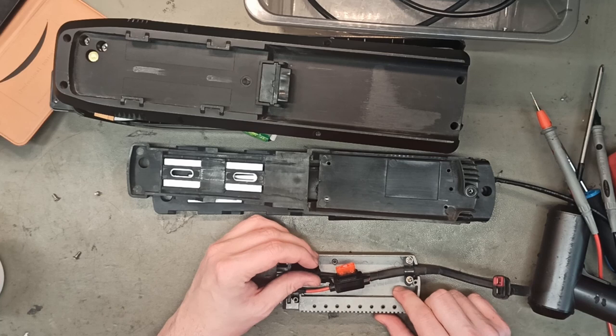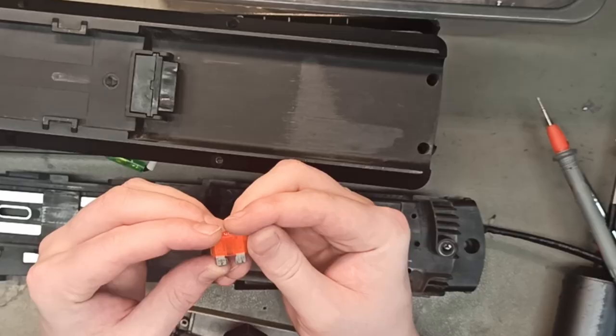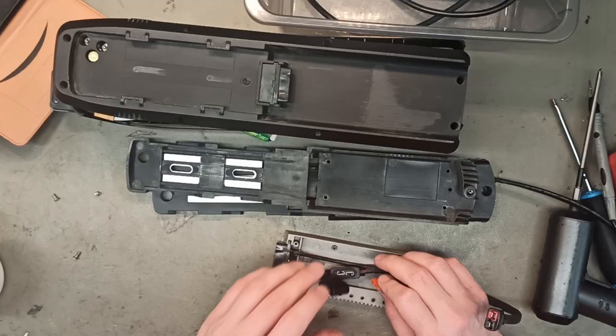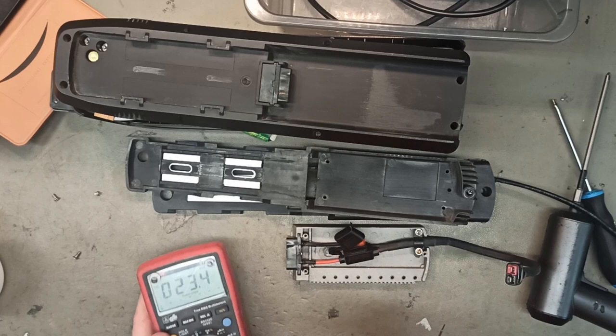The fuse looks fine from over here, but the angle looks very wrong — it might have melted inside. Maybe the customer checked the fuse and put it back together. The fuse itself is not broken, but there is a lot of grease on the connectors. If you scrape them you can see they're metallic underneath, but there's so much grease on both sides. I've now taken it out and scraped it, so we'll probably have better continuity than before.